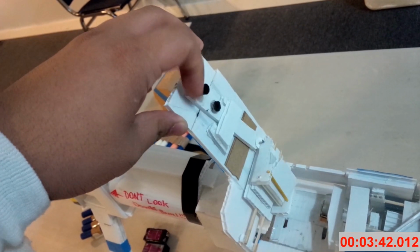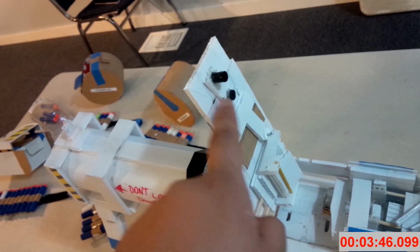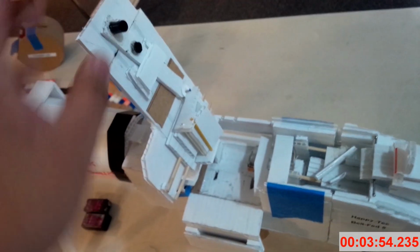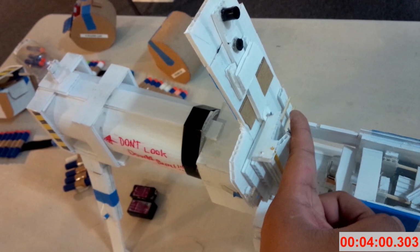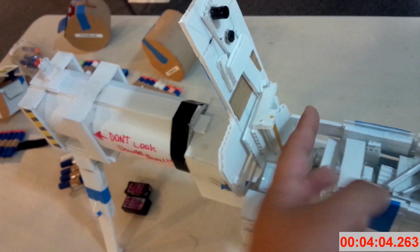What would happen is, as this moves back and forth, this would be in there, and it would constantly move this little pivot right here on the arm, which connects to a pin that falls in here. As that goes back and forward, this would go like this. This is a one-way feed, meaning it'll go over the chain, but on the way back, it'll actually grab onto the belt and advance it.